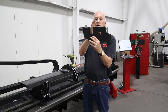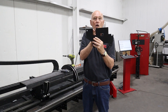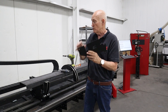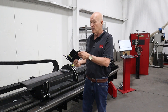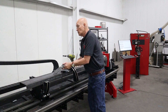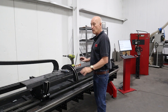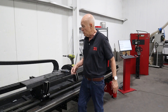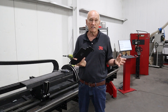They are installed using two 10-millimeter bolts. On this particular one we've got a flat surface that we're going to lay the c-channel on, and then we have this slot here — this slot is our backstop, and it is four inches from the middle of rotation because we're working with eight-inch c-channel. Once these are bolted into the machine, you come up with your forklift, place the workpiece onto the flat surface, push it to the rear against the backstop, lock everything down, and you know it's in the center of rotation.